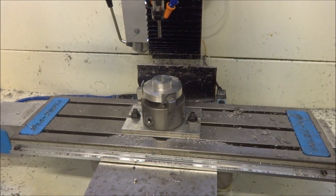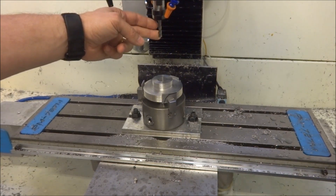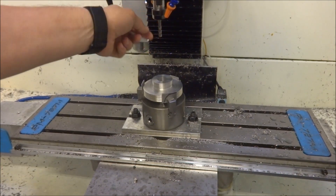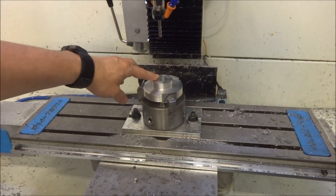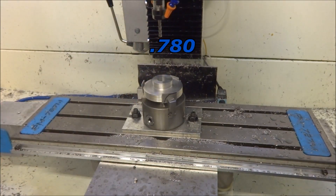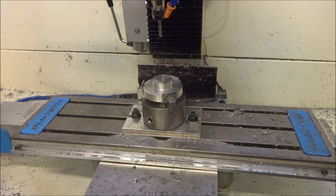I've got it set up now. This is a quarter inch four-flute end mill — I don't have a two-flute long enough, so I'm using a four-flute. We're going to be going about 0.87 deep, running at 3,000 RPMs, and we're going to be doing a spiral cut of about 0.040. Let's get started.